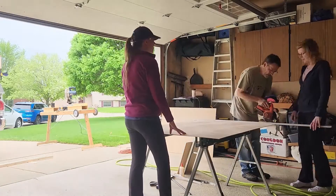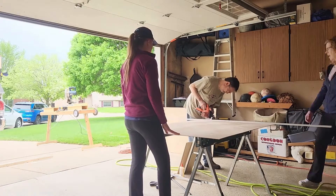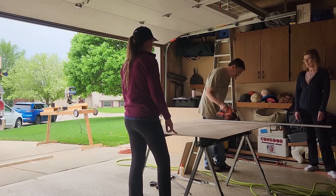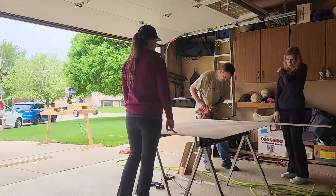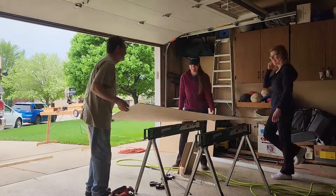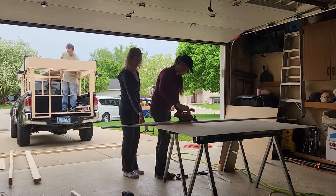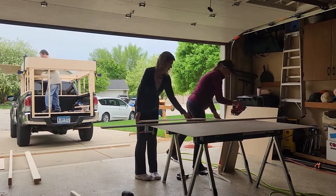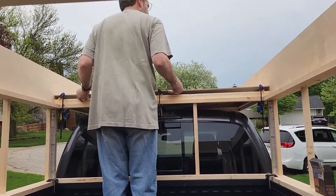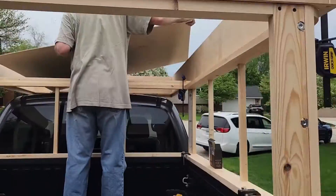Just like the wall design, for the bed platform we also used a piece of plywood on either side of the framing — two pieces of plywood, one for the top and one for the bottom, sandwiching foam in between, and hollowing out that space for the shark fin. Another test fitting as we brought the piece of plywood up — it ended up needing a little bit of sanding for a perfect fit, then we put in the second piece which was also just a little bit tight and needed a tiny bit more taken off.